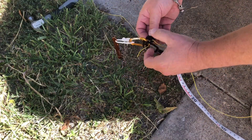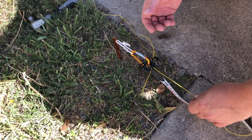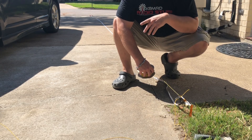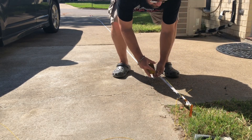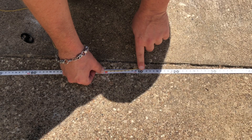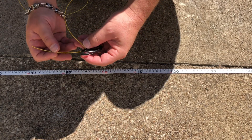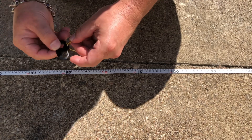This time we're going to go ahead and put the carabiner in here. Another reason I'm adding two centimeters is just because of this difference here — I'd rather have it too long than too short. Always be safe, I don't want to solder more wire onto this. Now, because I already have my 10 centimeter foldback here, I'm going to cut another two meters 43 centimeters — actually I'll cut it about two meters 45 centimeters. Again, we'll mark this at 12 centimeters. Keep in mind, I'm planning on cutting two centimeters off of this. The goal is to have a 10 centimeter foldback on all of this. I'm just cutting everything long. I've never made an antenna taking the length of wire from another antenna, so I just want to be safe. So that's our 20 meter link.